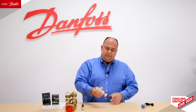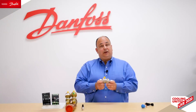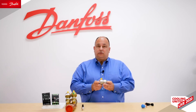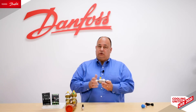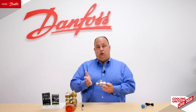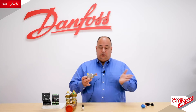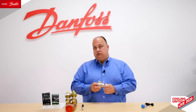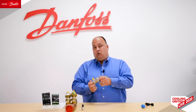Our next valve is the ETS-C Colibri — a very unique-looking, all stainless steel valve. The capacity range runs from about 12 to 140 tons, or about 40 to 500 kilowatts. This valve works with both high- and medium-density refrigerants: high-density refrigerants like R410A and its A2L replacements — R32, R454B, R452B — but also R134A and its replacements like R1234ZE. That's important because this capacity range straddles scroll applications up into screw applications for chillers. So this valve covers both a high-pressure, high-density scroll system or a medium-density screw system.